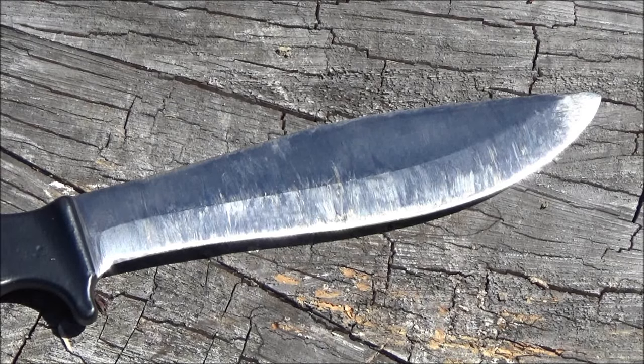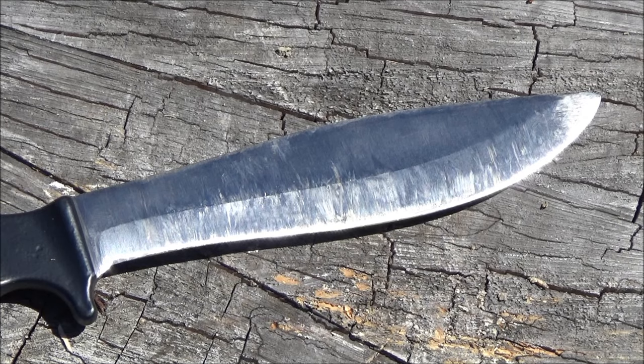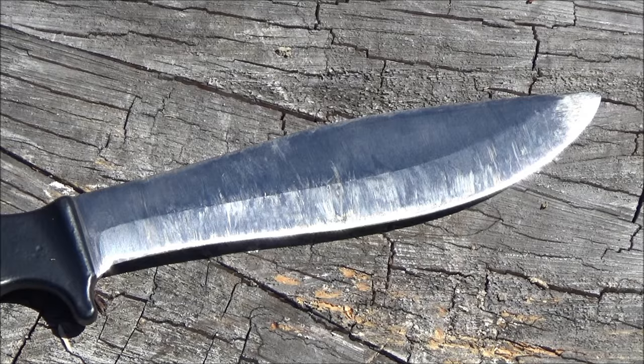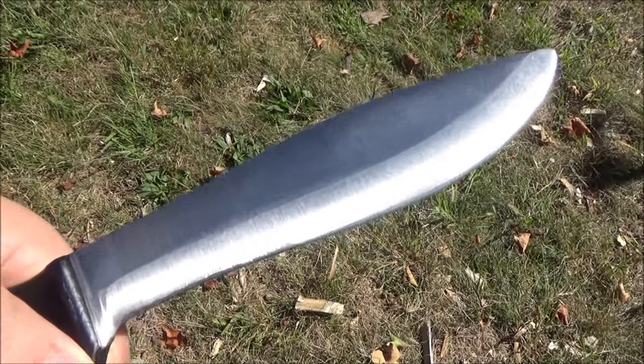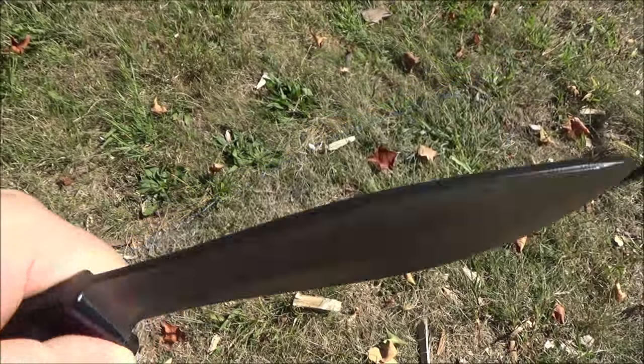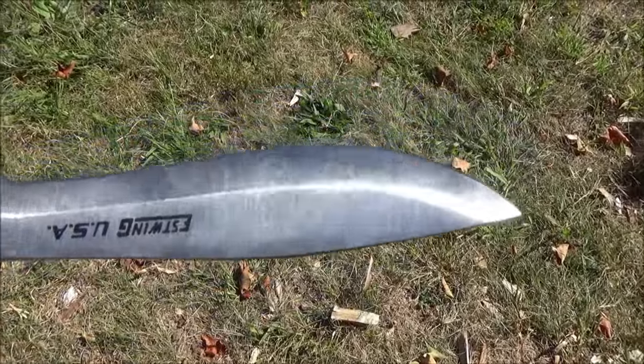There is the blade — 6-inch blade. They also have a 4-inch model, and they have a 6-inch and a 4-inch tanto. And I think this might have a clear coat. I know Estwing tools have an anti-rust clear coat on them; at least my carpenter's hatchet from them does. Now the way this came, they say it's hand sharpened. Well, it might be hand sharpened on a grinder, because mine had a really large burr when I got it.